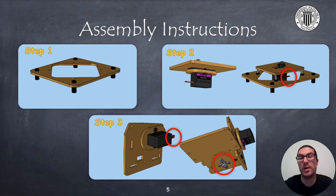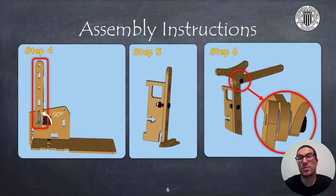In the third step we will screw another servo to the right side of link 1 and also fix the bottom part of link 1. Please take into account the direction of servo cables and also the fact that there is a double servo horn in the bottom part of link 1. In the fourth step, screw the right link 2 to the servo with a simple servo horn, making sure that link 2 has a 90-degree angle and that the servo is also at the 90-degree position before screwing those parts. Then screw the middle part of link 2 as shown in the fifth step.